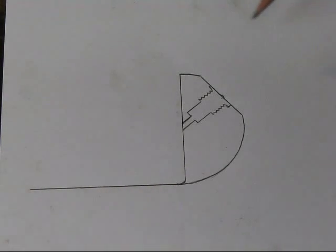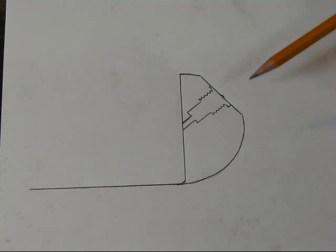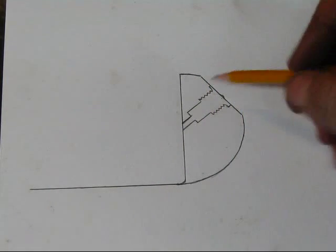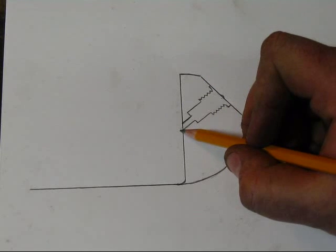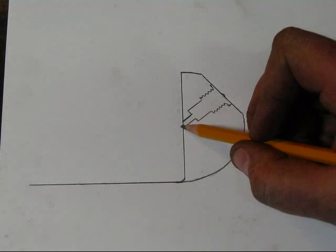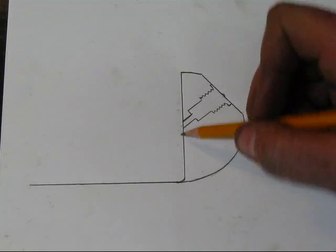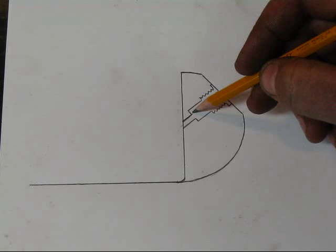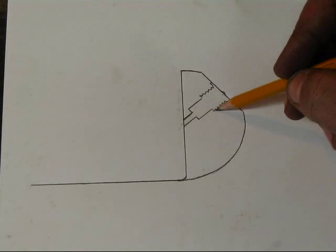This drawing isn't to scale, just to give you an idea of what's going on inside the firing pin hole since I can't get the camera down in there. So here's the breech face, the water table, and the radius of the dome behind the breech face. The firing pin hole penetrates the breech face just slightly above the center line of the primer. The reason is that with the angle it comes in at, going center to center would produce glancing blows at the bottom of the firing pin — drilling just a little ahead gives the angle time to reach center. Then it opens up to a wider section where a return spring and a shoulder on the firing pin sit, and then opens wider again to the thread diameter.